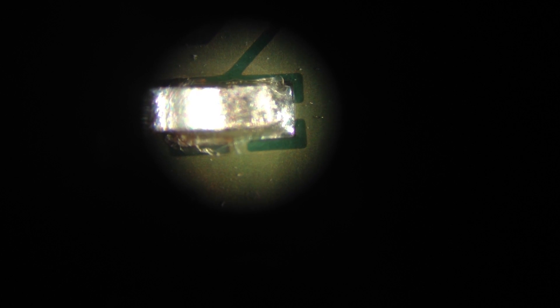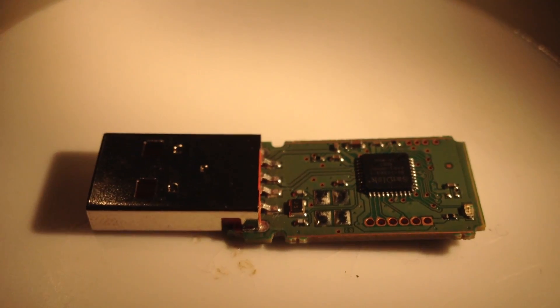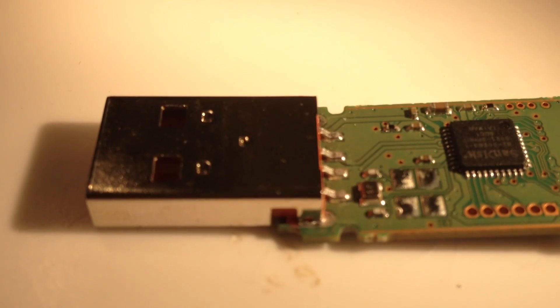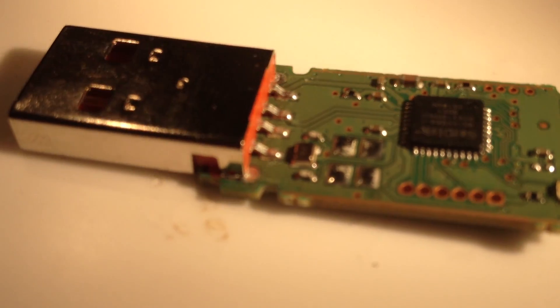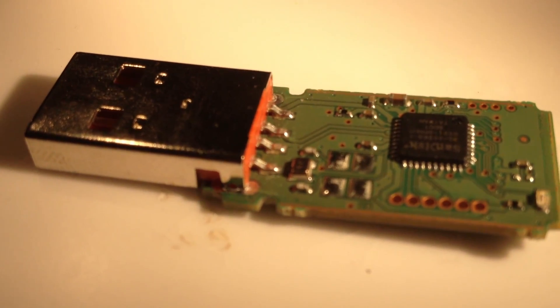So if there are any via points, they are not attached anymore. This one is also lifted — not all the way — but the best thing at this stage would be to actually remove the connector and manually reattach all of the pins to their proper position. Trace them and get them reattached by soldering a piece of wire to each one.